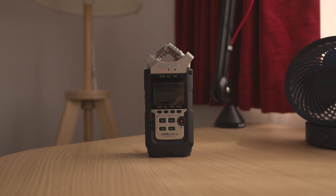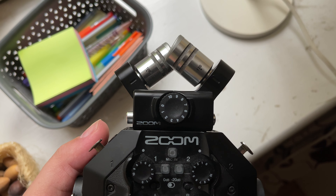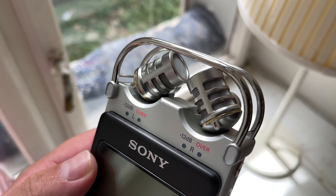So why are they not quite as suited for quiet recording? The internal components of any recorder will produce a certain amount of hiss. This hiss is present in all recordings, but it's way more noticeable when the recording is quiet. When you increase the gain, what you want to record becomes louder, but so does the hiss. What you want to achieve is a good signal-to-noise ratio — more of the sound you want to record and less of the hiss. There is a physical limit to how close you can get to your sound source, so you want a device with as little self-noise as possible. The PCM-D100 is by far the best in that regard. The problem is that it's currently not easy to get a hold of and prices have skyrocketed. The PCM-D100 also has self-noise, but it has less than any other handheld device — you just need to pay for that perk. I've also reviewed the PCM-D100 on this channel; link down below or click the card in the top right corner.